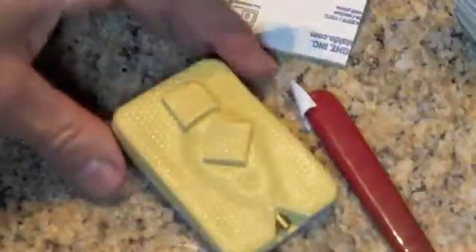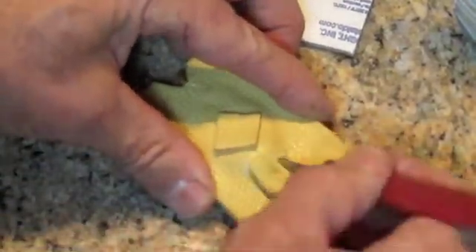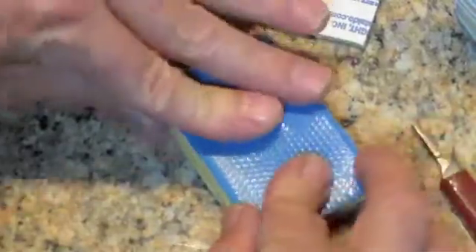So I put these two pieces in here to fill more spaces in the mold. You'll notice that I'm packing these extra bits of rubber where I want to apply more pressure — like at the top of the ring and also in the center of the ring. It's going to allow more rubber to flow in and around the ring when we start to heat it in the vulcanizer.